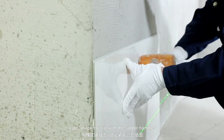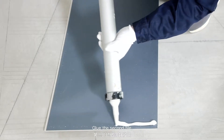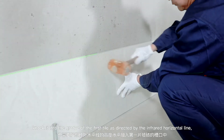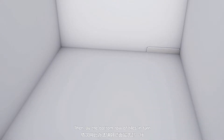Third, keep the groove on the tile's long edge upwards and lay the tile along the infrared horizontal line. Last, knock the tile with the rubber hammer and support it with the height adjuster. Glue the second tile, knock it into the groove of the first tile as directed by the infrared horizontal line, and support it with the height adjuster. Then lay the bottom row of tiles in turn.